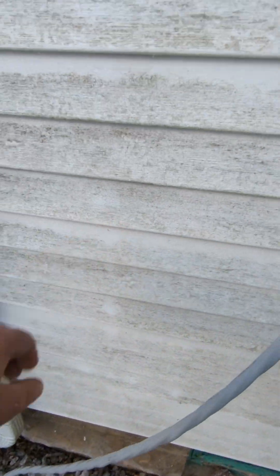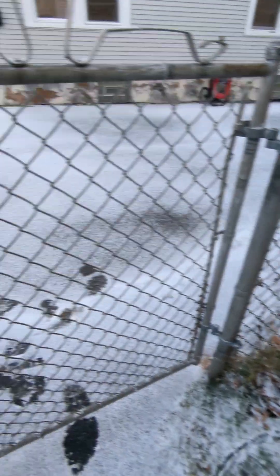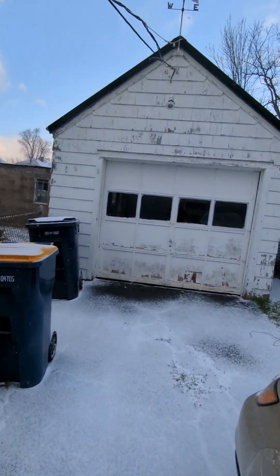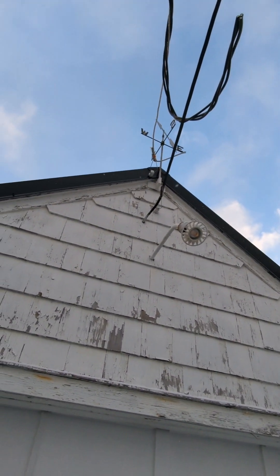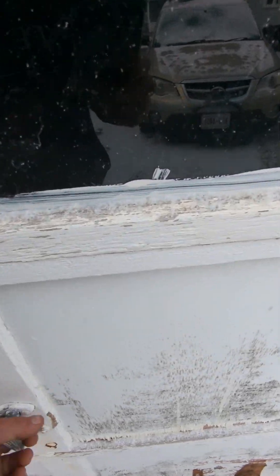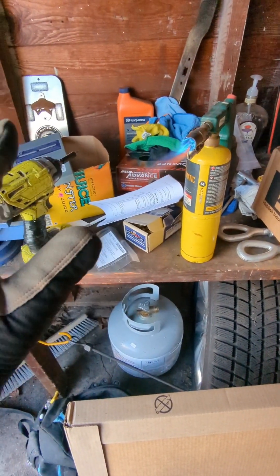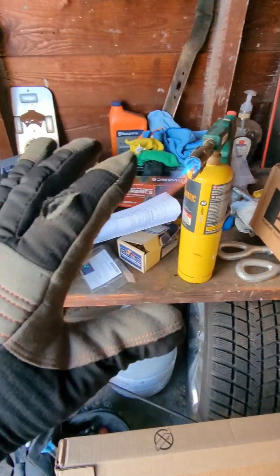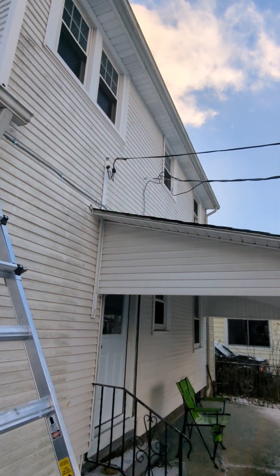It's going to go to the main panel — for now I'm just hooking it to a 40-amp breaker, but I can hook it to a 50-amp breaker if I want. Over at the garage, I'm going to pop out with my SER, put the weather head on it, put my splicers in and connect, then come down and install my sub panel right here with the SER coming down and feeding it. It's so cold out I'm trying to get feeling back in my hands.